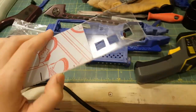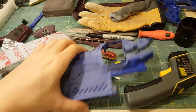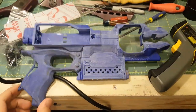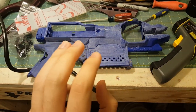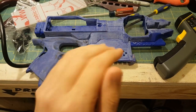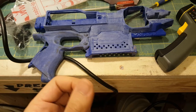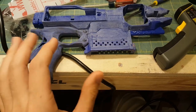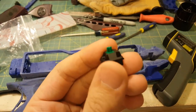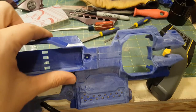Basically, I cut out some polycarbonate — as you can see here — and that took a little bit of drilling and hand-filing, but I eventually got it. That's going to be sitting somewhere up here diagonally. These switches will just be little tactile switches right there, and they are going to control the colors in the RGB LEDs, because the little control panel just has dome-type buttons — a waffle pattern of contacts on the PCB with a little dome of metal that you click down to activate. Unfortunately, it's very mushy; you don't get any feedback at all. So obviously that's not good enough, hence the nice Cherry MX switches. Blues are way more common, so just compare that with a heavier load spring. Nice little click there — that is going to be nice, sweet, and to the point.